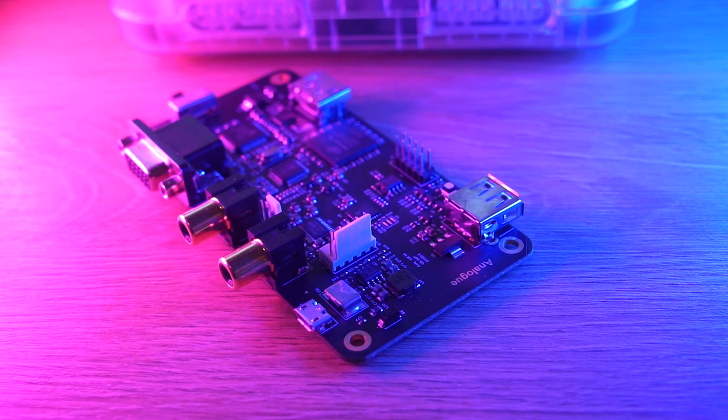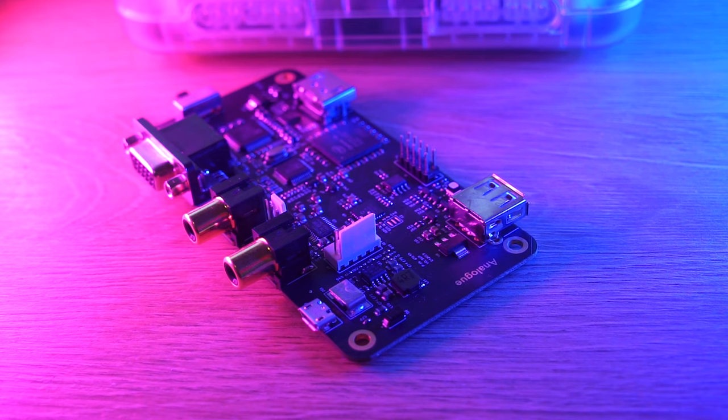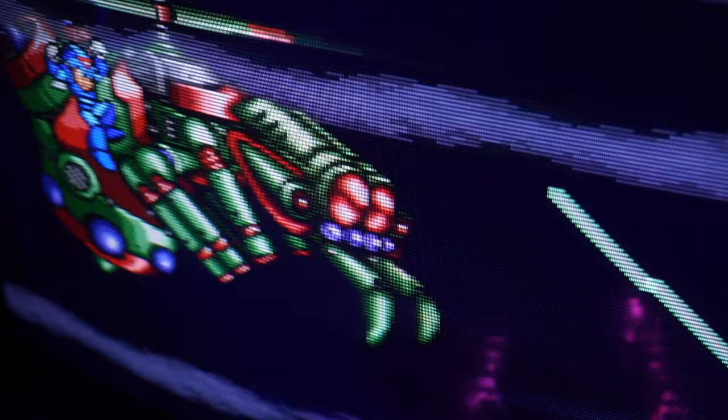There are several RGB modes, such as 75 Ohm C-Sync, Sync on Green, and so on. The DAC is designed to be compatible with Monoprice VGA cables, which adapt the D-sub-15 pinout to whatever cable you need, like the SCART cable that I'll be using for this review, borrowed from my MiSTer.